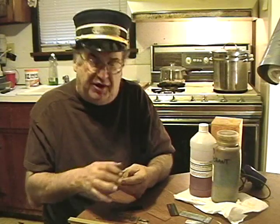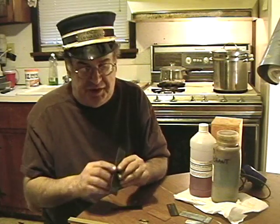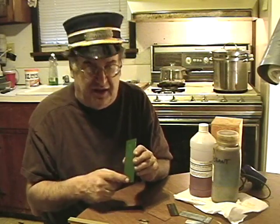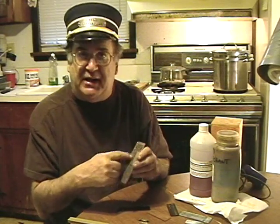There is a spray you can spray on the metal — I haven't tried that yet, but it probably works pretty well. But I was able to find copper which is 1/16-inch thick, which is the perfect thickness — nice and heavy duty — that has the resist already on it. And on the back side, as you can see here, it's resisted as well; it comes that way already made. This side can be exposed — there's a lacquer or some kind of paint on there that acts as a stop-off so it doesn't etch on the back.